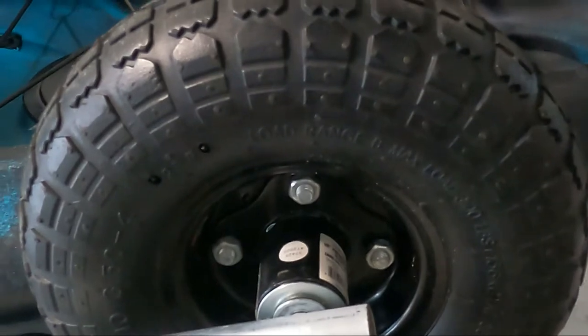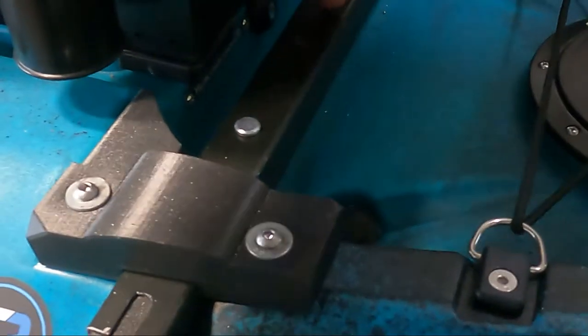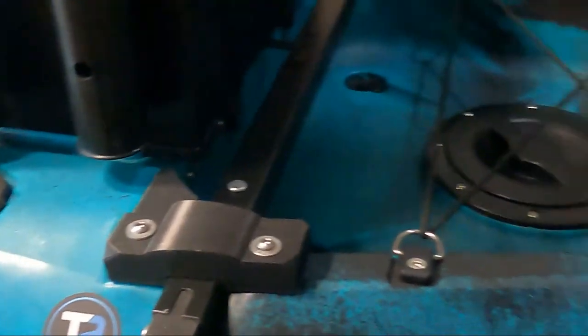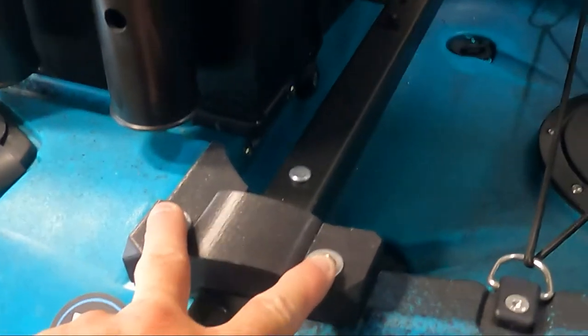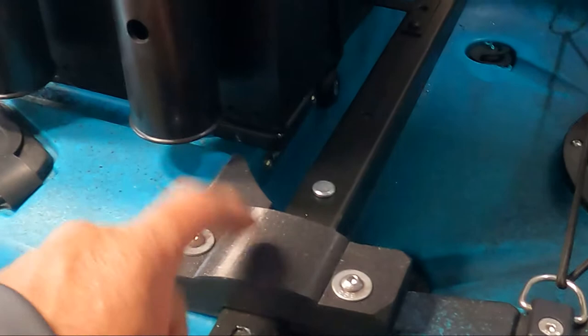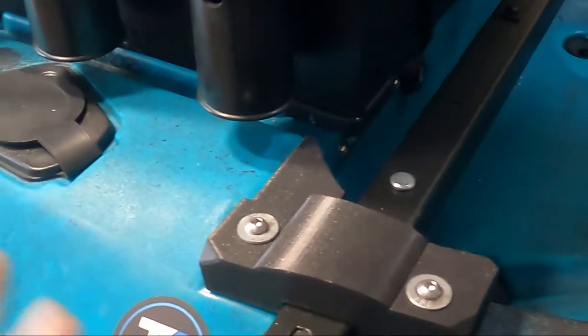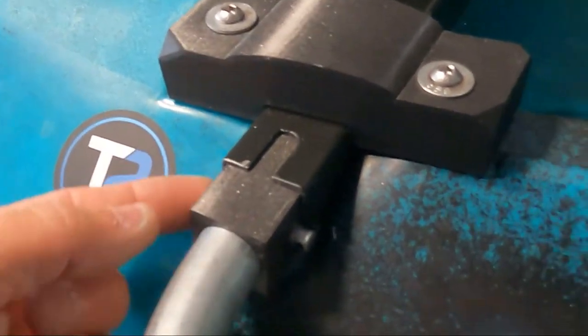The main thing is make sure these tires are installed to the inside of the conduit, not the outside — it alleviates pressure from the conduit. You've got a 30-inch piece of conduit bent on a 45-degree angle, and from this point to down here you have about nine inches of bend. Up here is what the kayak looks like in the stored position. You've got a 3D-printed part which is your top brace, going on with two 6mm by 40mm set screws, two washers, and a steel plate underneath to stop the bracket from breaking. I've made a lot of changes and this new setup works really well.